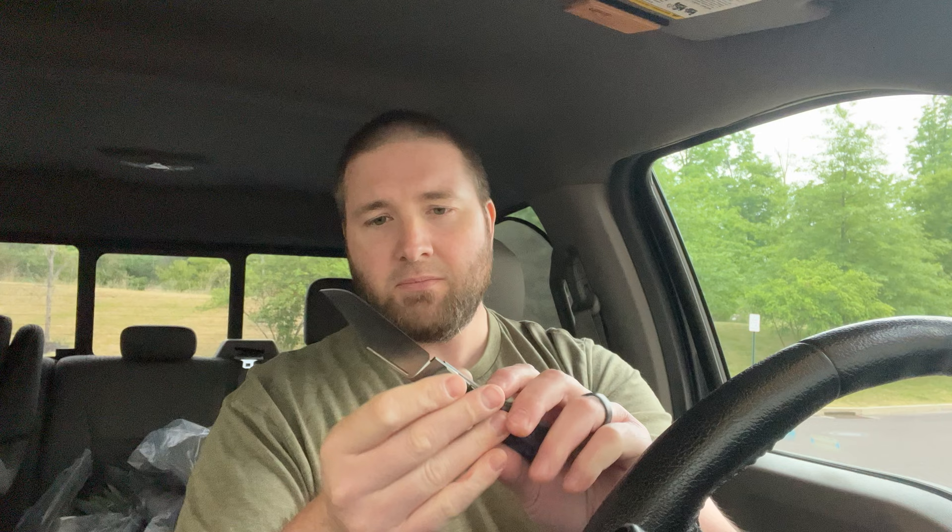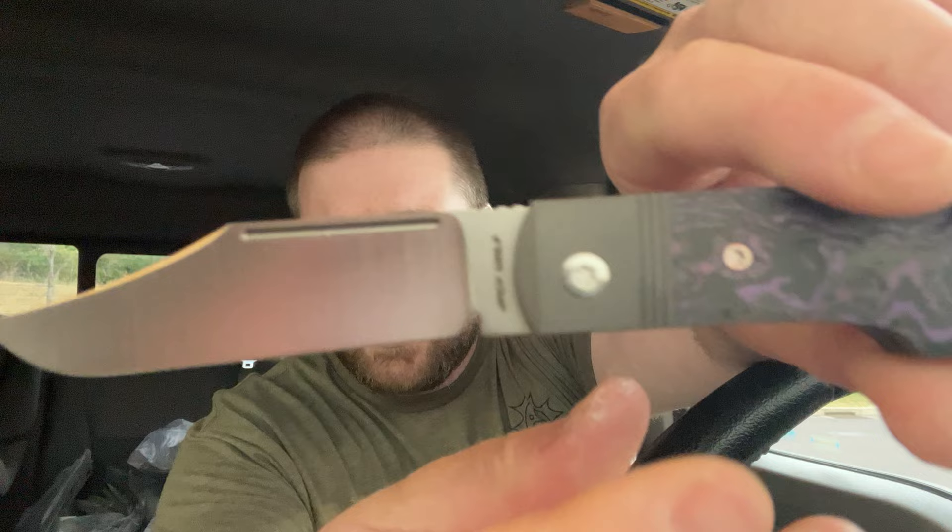Personally I would love to see it be a little more drop shut, but it's kind of going to be his trade-off with a blade like this. You have this full hollow grind, belt satin. Look at the stock — it's relatively thin stock and then it's a full hollow, comes down to absolutely nothing. This is ten-thousandths behind the edge or something like that, so it's just not going to have weight to it. It's not going to swing down the way you traditionally see a lot of knives do. That right-hand reverse flick is just so good. I just got to practice it lefty.